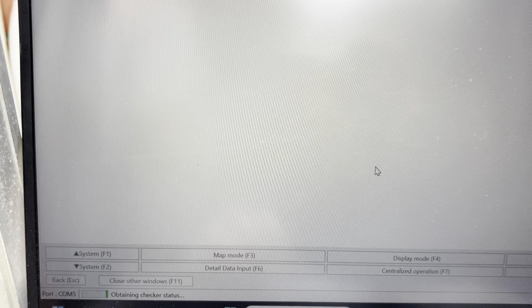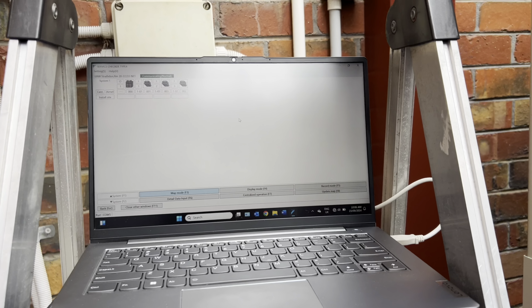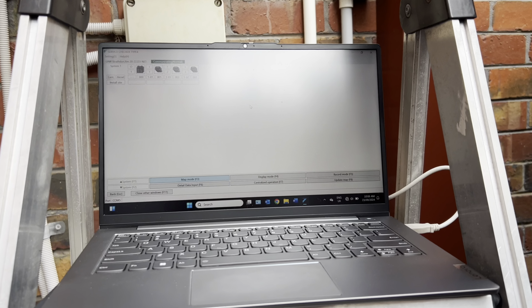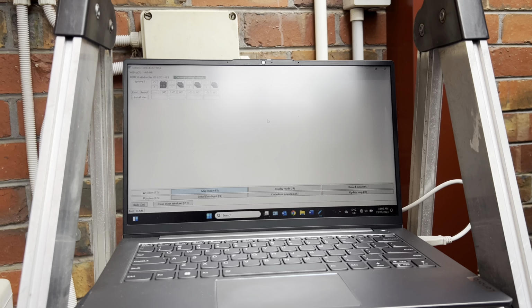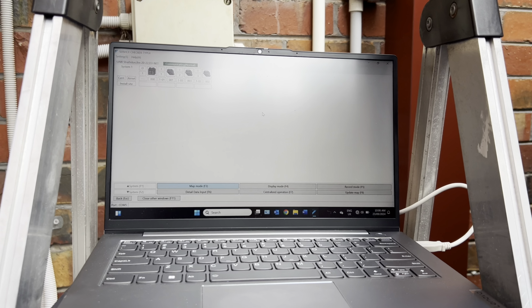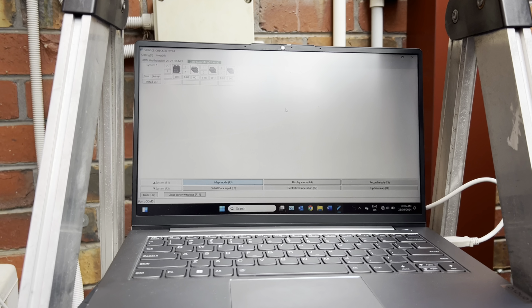Alright, just building the site map now. We'll make sure that we're seeing what we think we should. Alright, we're all set. AirNet addresses and group addresses are all set, so we'll get into testing the ports. So basically, I'm just going to turn one indoor on at a time, make sure that the one that we want to turn on is turning on, basically just confirming that there are no cross wires or cross pipes or anything like that. Then we'll put it into a full test heat, probably, and add the additional charge, which I've still got to get confirmation on, so we'll jump into it.